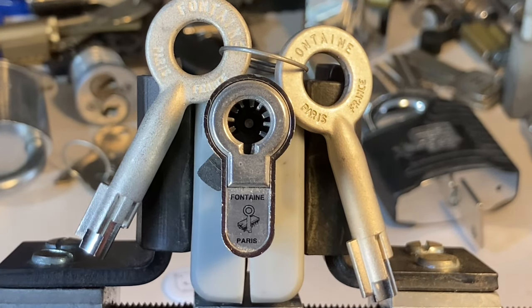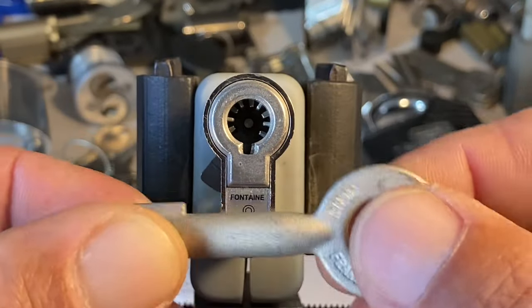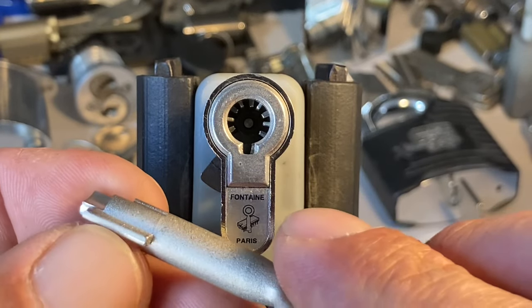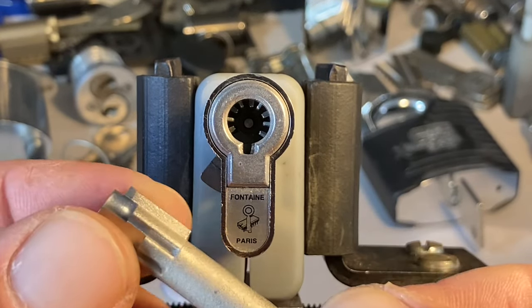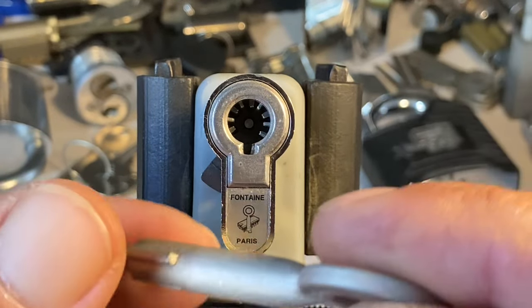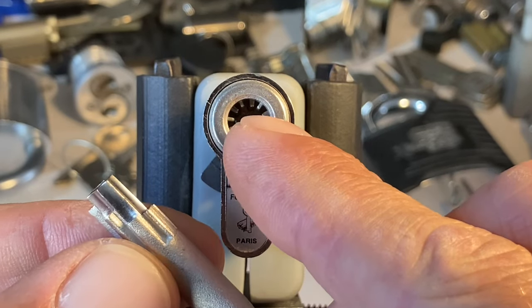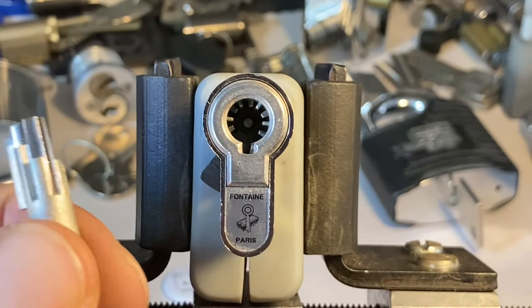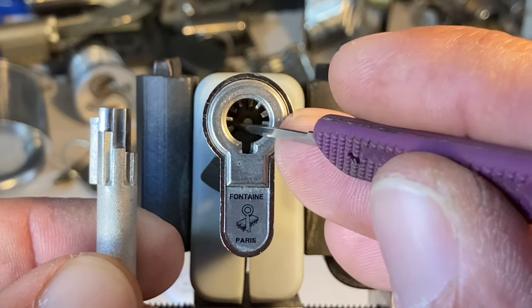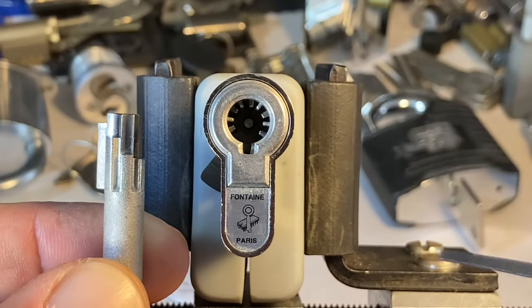This is a French pump lock. I can't really tell you much about it, I honestly don't know. If we have a look at the key, we've got a little flag there by which the barrel's tensioned, otherwise a circular keyway, so not much to tension off. Although there are little fins between all of the active pins, or sliders. I suspect what we're looking at here is a slider lock with stators.